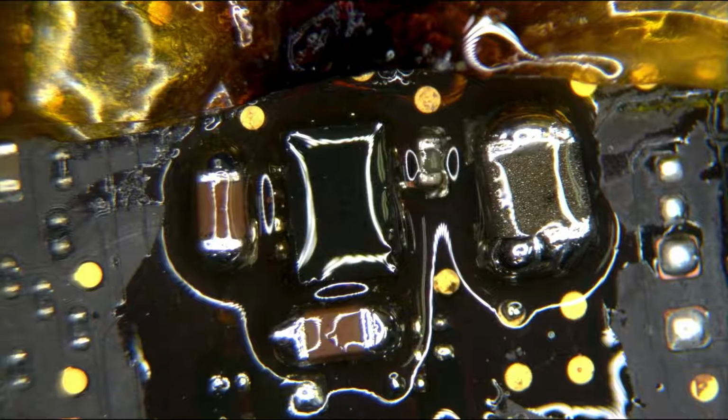So anyway, this resistor over here. You can see this is the chip that creates PP3V42, this is where it outputs. Now here you have R6995 and R6996, which goes to PP3V42_G3H_FB, which is for feedback. If you don't know what that pin means, you can always look up the name of this. You can Google the chip LT3470AED. You can get a data sheet for that chip, and that will tell you. So I looked on the board view, and I noticed I had C6995, R6995, but I did not have R6996 there. Therefore, the feedback network was not fully functional.